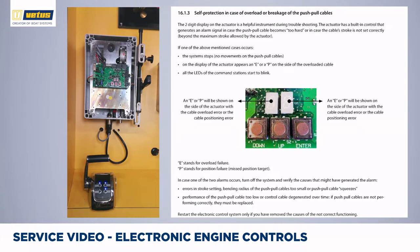There are several self-protection modes in the system. One protects the system against overload if it takes too much force to reach an end position. The second version is where the end position is reached or almost reached and there is an error close to that end position — for instance, if the stroke wasn't adjusted properly, there will be an error close to the end position and the system will go into error mode in about 4 minutes. When there is an error during the stroke, it will go into error mode almost immediately.